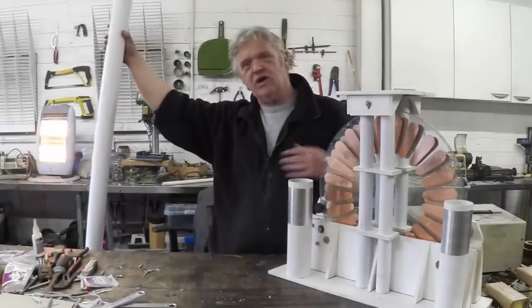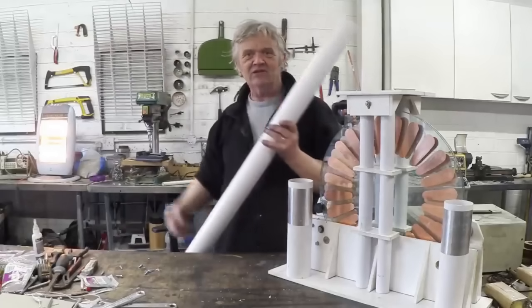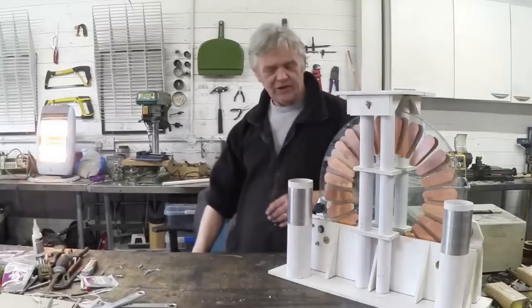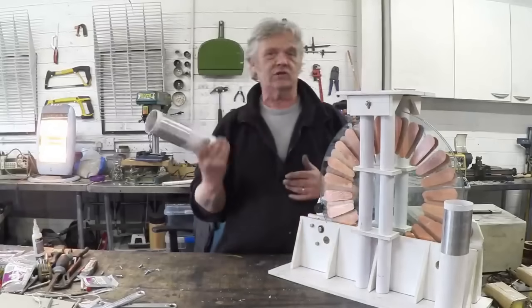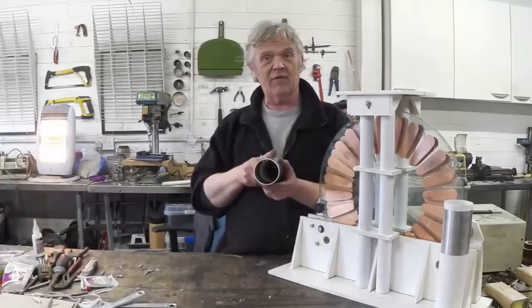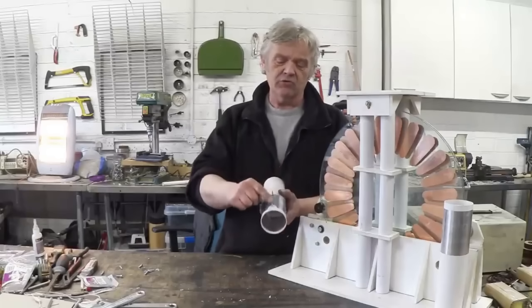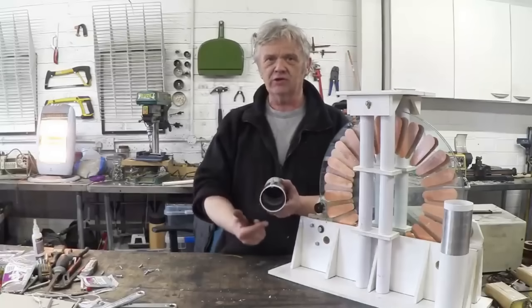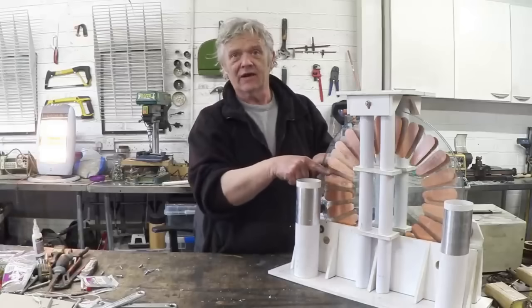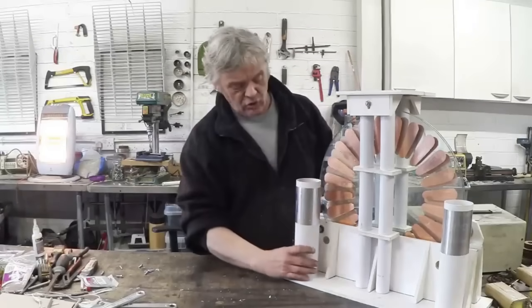We're on with our Art Deco Wimshurst machine. What we need to do is make the capacitors, current collectors and neutralizers. The capacitors are made out of 75mm diameter down pipe — just cut off a couple of sections. I've taken aluminium HVAC foil, wrapped it around the outside and another piece on the inside. Then I've scraped some off and put a couple of bolts in — one bolt connects to the inside but not the outside, and the other connects to the outside but not the inside. The two outsides need a strap to connect them together, while the two insides connect to the current collector.